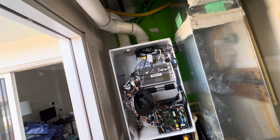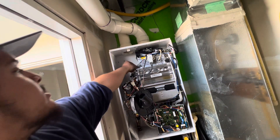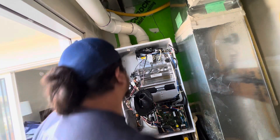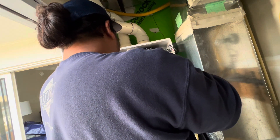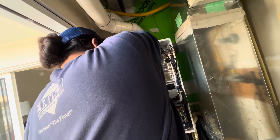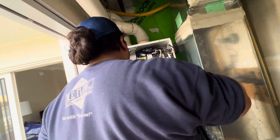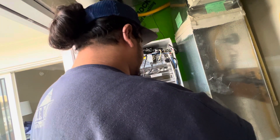All I'm doing now is using my knife scraper to remove the excess gasket material, being as careful as possible not to let any debris drop down into the chamber — because that's where the ignition happens. I wish I had my proper scraper but I didn't bring it.